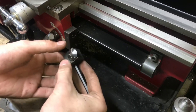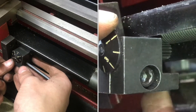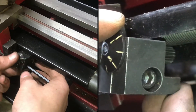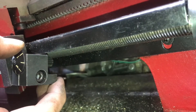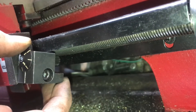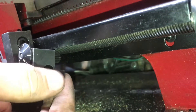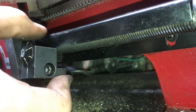Probably the most common reason why this isn't going to spin is because the screw slowly loosened up and this moved down a little bit so that pinion gear isn't resting on the lead screw. If this screw loosens up, it can fall down just enough so whenever you move the carriage it's not going to touch. So you want to check to make sure this screw is tight and look at your lead screw and make sure that this is pushed up into the threads.